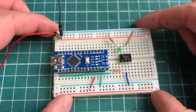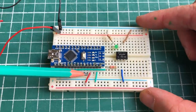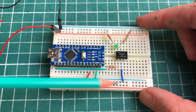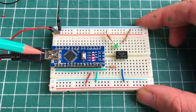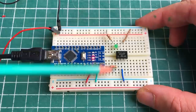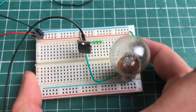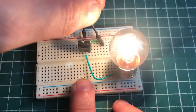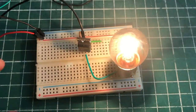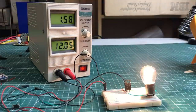To test the optocoupler I hooked up a small Arduino on a breadboard, powered via USB, to turn the optocoupler on and off. On the output side I have a separate 12V supply with an LED, and the optocoupler is capable of turning the LED on and off — so the optocoupler is working. For the thyristor, I tested it in circuit with a 12V light bulb and it appears to work as well, though it does get somewhat hot with a constant current of about 1.6 amps flowing through it, which is why it's mounted on a heatsink.